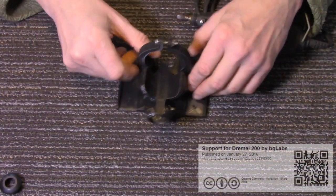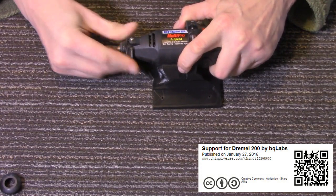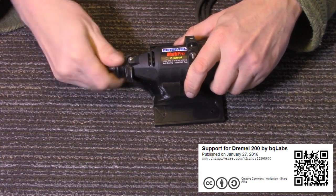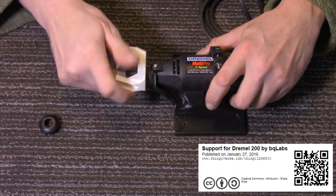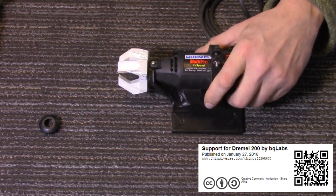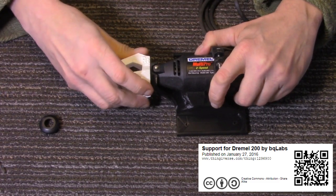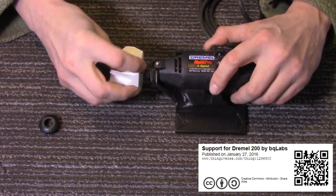This third one is really cool. If you want to have both hands free, you can print this out, put it in here. It has a screw to tighten and hold the back, and in the front you can screw that on. There should be enough threads for a flex arm too — I don't have one but it'd be handy. The drill bit screws on there as well, and you can get to the 90-degree angle from the side, which helps with using the drill bit sharpener. You can turn it snug enough to reach the 135 and 118 degree positions before it loosens up. That's cool — I hadn't tried that before.